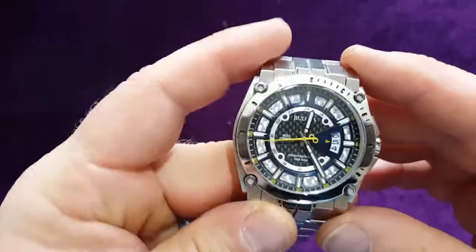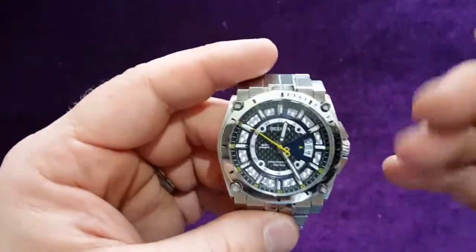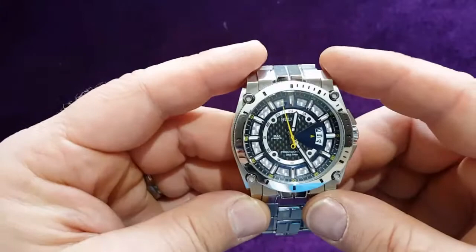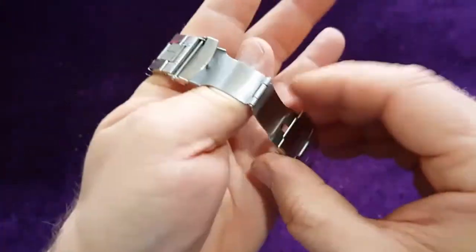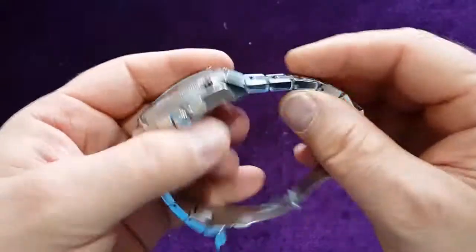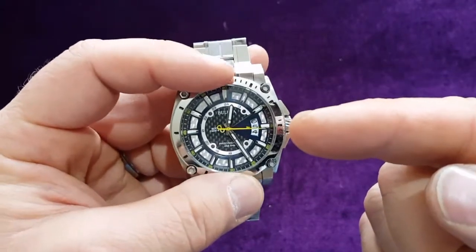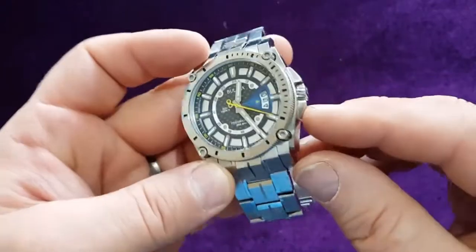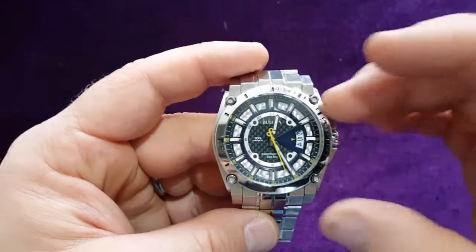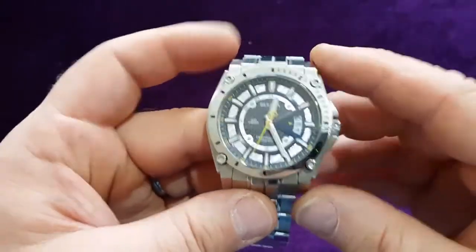When I say space and quartz, that means quartz is not so resistant to temperature change. Each regular quartz watch is temperature-regulated for the human body temperature. This is actually a bit small for my wrist but I have three extra links so I'll change them — they're screwable so no problem. For the space environment they made specially temperature-regulated watches because it's very important for the quartz watch to stay at the same temperature. If you change temperature, you change the accuracy of the quartz — very simple.